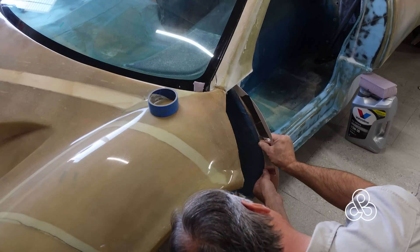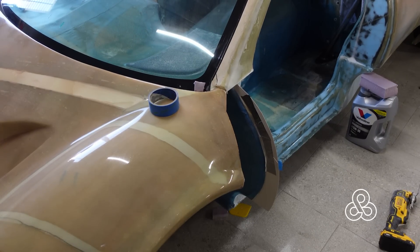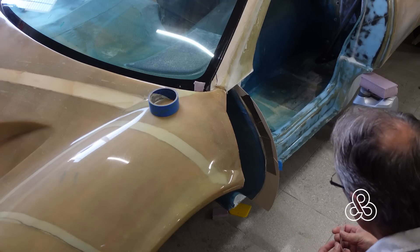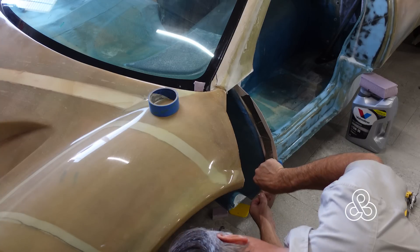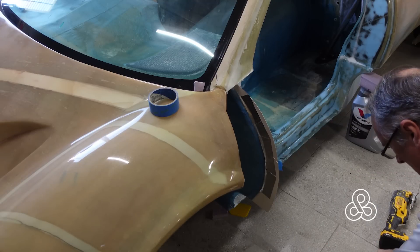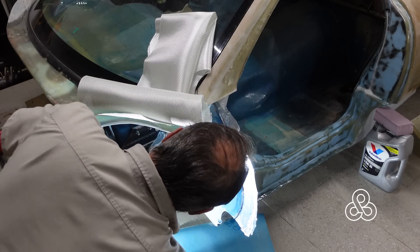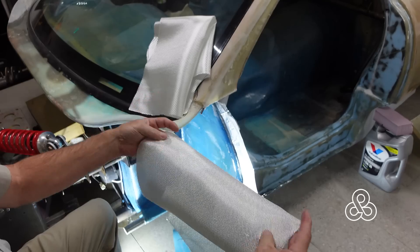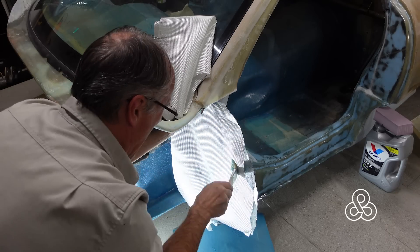That little template I created — I don't want it to bond to the laminations we're going to do on the front of that thing. So I'm going to put some aluminum tape on here and wax it just so we can get a release from that and our laminations. This is aluminum flashing tape for putting in heating duct systems — excellent for covering something if you want to get a release on it. It will accept a releasing agent or wax. Once we've got that thing all coated, we're going to do a lamination on top of that. I just put three or four layers on here to extend this little panel bulkhead out right up to the edge of our template. That will form the edge that we want.